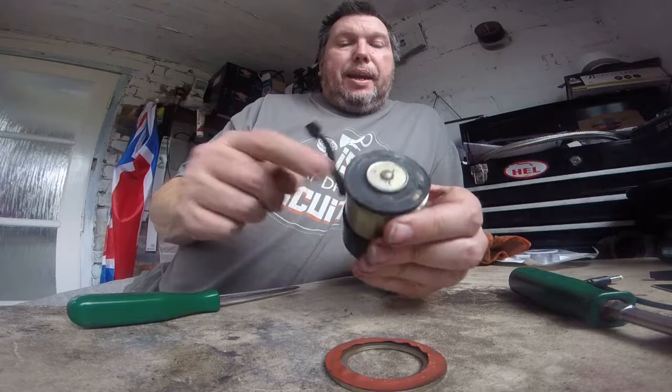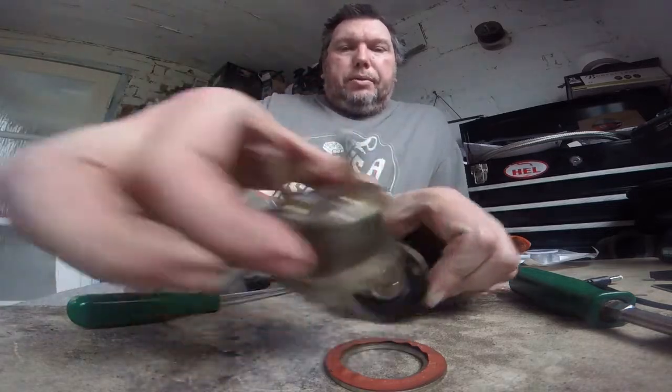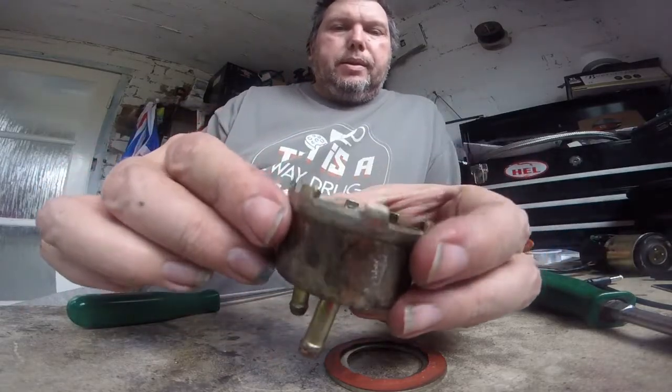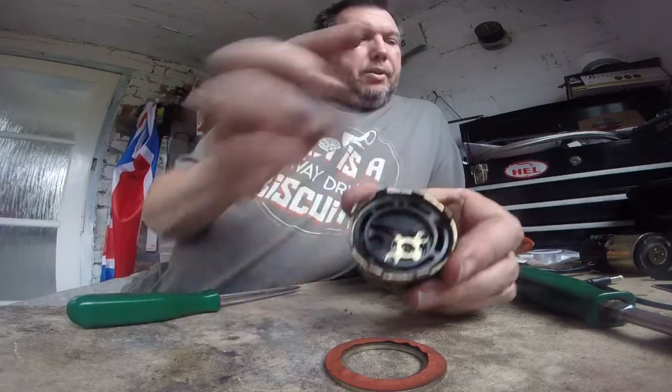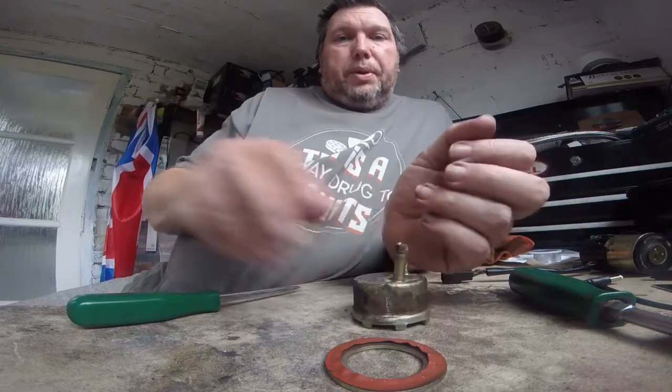Stop the petrol going in here, basically. The petrol only goes in the top part. I have bent those, and this is the top part, and so it will suck fuel in one end and shove it out the other with the action of that diaphragm. Very common type of pump, diaphragm pump.